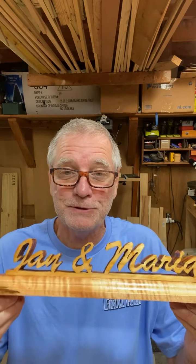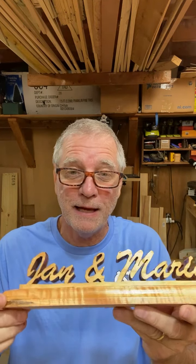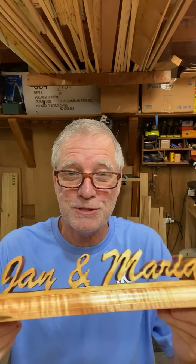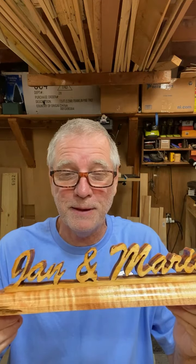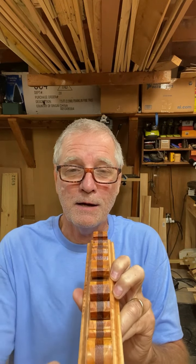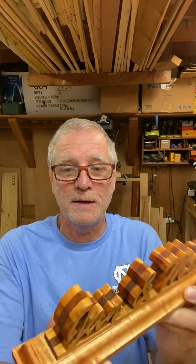I finished the name plaque, and I think it turned out looking great. A couple things I want to show you about the name plaque: I used a spalted maple wood for the base, and after putting a stain on the plaque, you can see how that spalted maple just shimmers and shines. And also I want to highlight how using the pine and the cedar within the lettering of the name plaque gives a really nice clean look. In the description below, I'll give you a list of the scroll saw blade and the router bit I used and the name of the stain I used to stain the plaque.